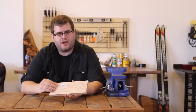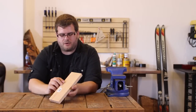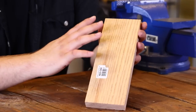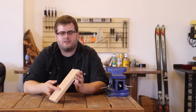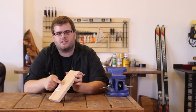Here I have a piece of red oak that I got from a local lumber store. It's pre-processed and treated, but the thing you really want to check is the grain — that's what's going to determine if it's a good piece of wood. This process can take a long time at the lumber store, and you'll get a lot of looks because people don't usually go through every board checking grain. For construction or furniture, people want decorative grains that look nice, not straight grain. But for bow and archery use, straight grain is what gives the wood its strength.